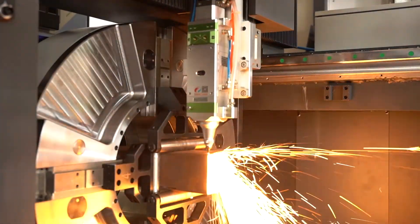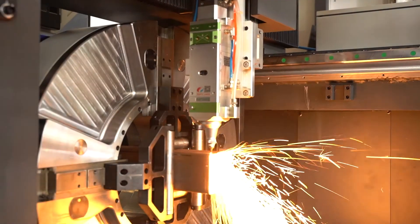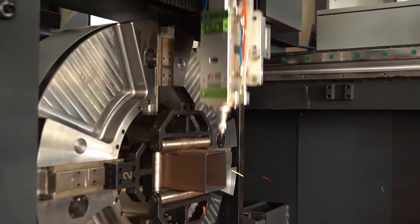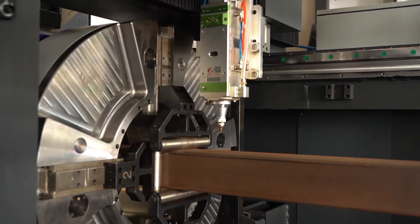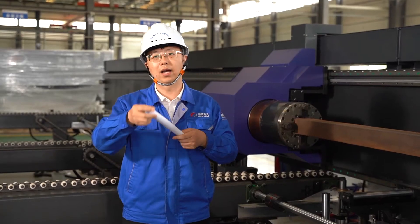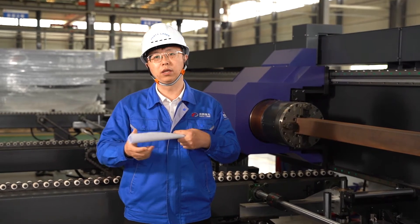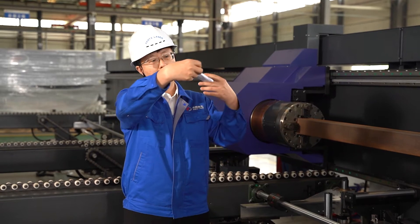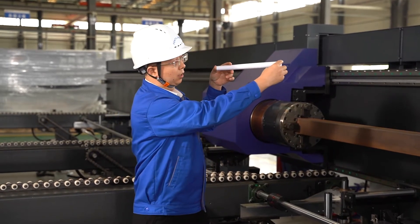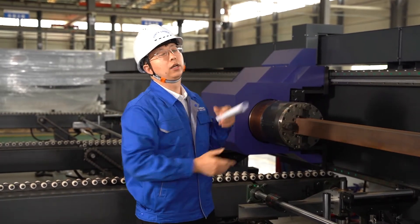If the finished product is long and the front extends to a 2 meter long workpiece, at that point the front is 2 meters long and the back is only 200 mm. The lever radius of gravity of the pipe becomes very large — a 10-fold lever — which will completely bow the pipe and cutting accuracy will be completely lost.